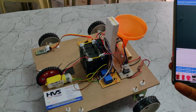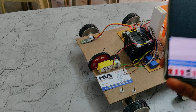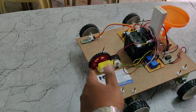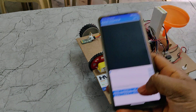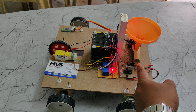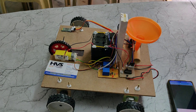After configuring, you can directly control the robot. Click the 'f' button to move forward, then right, left, and backward. Press stop. When you press plow on, the plow will activate. For demonstration purposes the plowing sharpness is kept low; in real-time use it needs to be increased to dig the ground. When seed on is pressed, the seed motor rotates, taking seeds from the funnel through the hole and dropping them below. Then press seed off.